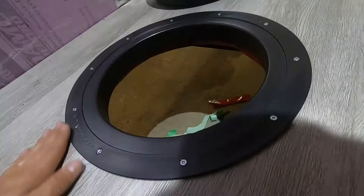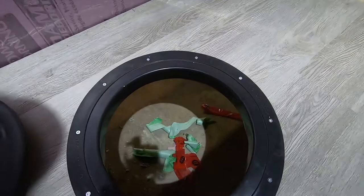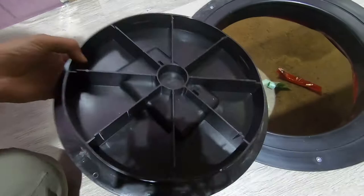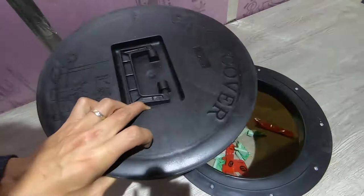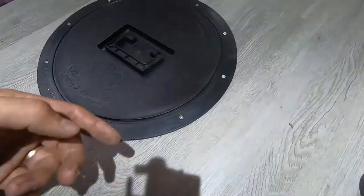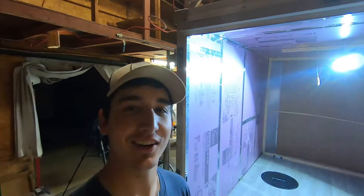Then simply when you're not using it, you just put the cover — the hatch — back on, and this thing is super sturdy; you can walk on it. I might try to do something with the bottom edge — maybe I can use the cutaway piece and actually insert insulation into these holes. Not sure yet, it's not a big problem on my mind right now, but I'd like to insulate this catch cover so it still serves a purpose other than just being a big hole in the floor. I actually got lucky here — I hit the beam with one screw and it wasn't going in. I don't have any self-tappers with a matching Robertson head, so I drilled a hole using a small bit, and that gave the threads something to chew into the beam. So this one screw is actually in the steel beam below. Catch covers are in — look at this! How many cargo trailers can you say have laminate waterproof flooring and ice fishing holes?